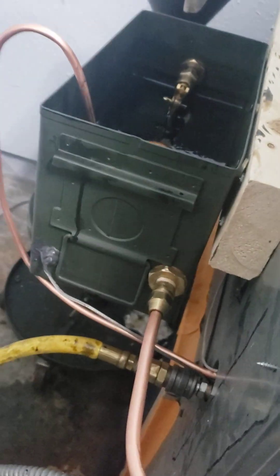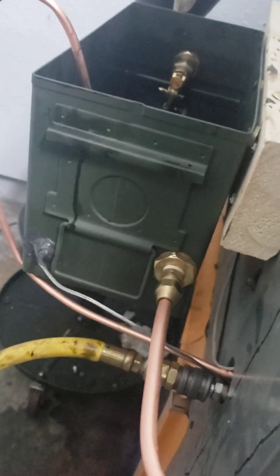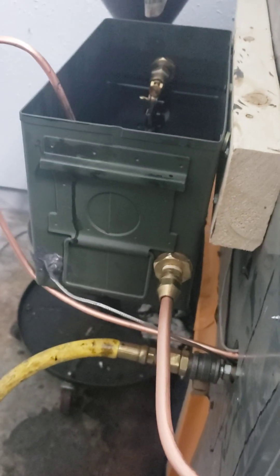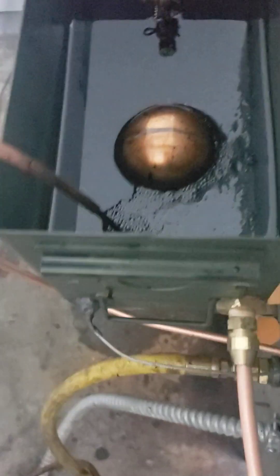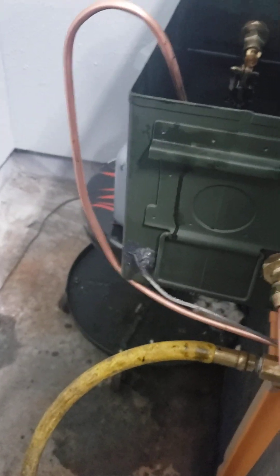I preheat the oil to about 100 degrees Fahrenheit. From there, the oil comes through this tube into the pump. One tip I picked up from other videos: make sure to put the outlet higher than your heating element, so if something goes wrong and the furnace drains your auxiliary tank, the element stays protected. The thermocouple is piped in where the oil is being circulated from the pump, which works really well to give the controller a solid temperature reading.